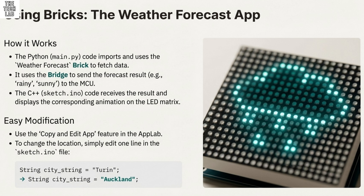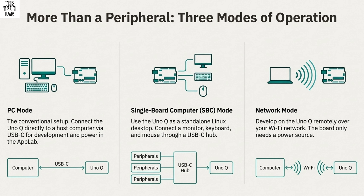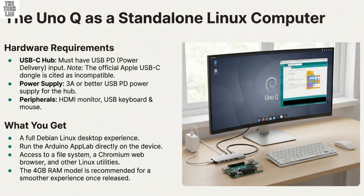For new features, there's built-in Wi-Fi 5 supporting both 2.4 and 5 GHz channels, as well as Bluetooth 5.1 and Bluetooth Low Energy. Physically on the board, it includes a dedicated boot pin needed for firmware updates, and it features a multi-color LED matrix display similar to the one on the R4 Wi-Fi. That's what the sources call the CharliePlex display — a technique that lets you control a high number of individual LEDs using a much smaller number of microcontroller pins. Very efficient, and it gives you built-in visual feedback right out of the box.